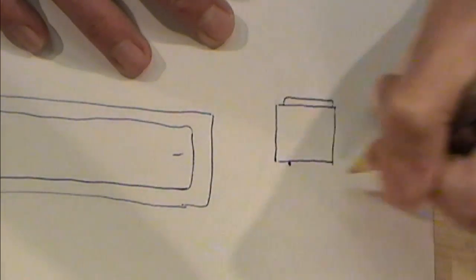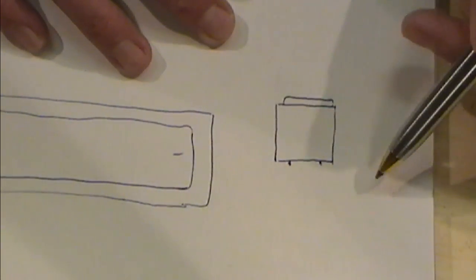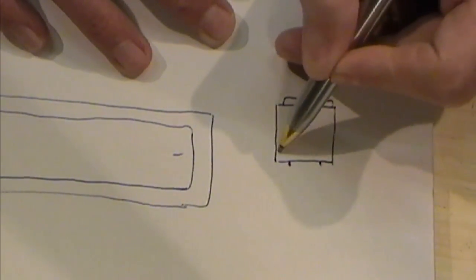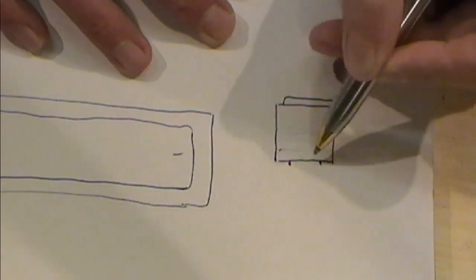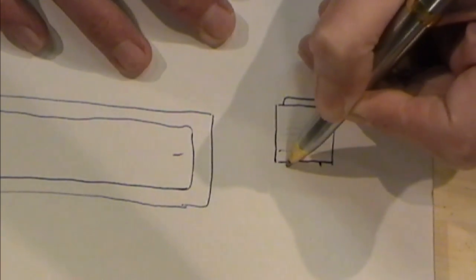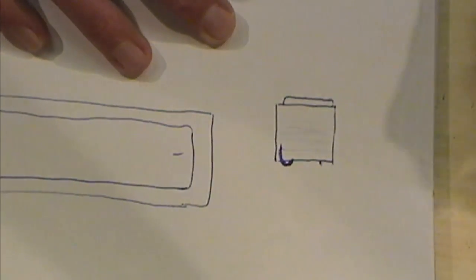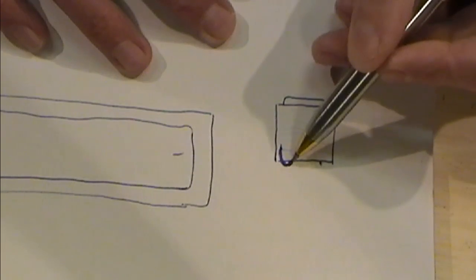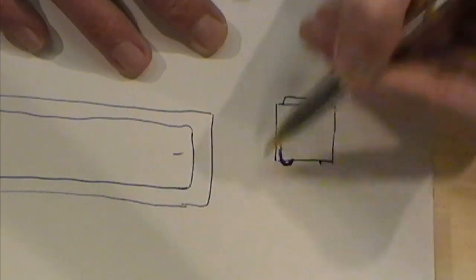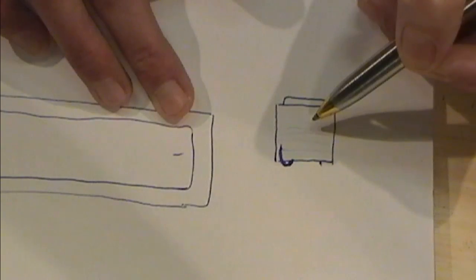Now, you'd normally have two little prongs coming up that you'd make your contacts across for your switch. What I've done in the past is, if this is a metal switch, you can actually connect very carefully one of your pins to the body of the switch. So form a link round. So you're actually connecting one pin to the body. Now the purpose of this is that when that switch is screwed in, you've already got one pin of your switch connected to the body of the mod.